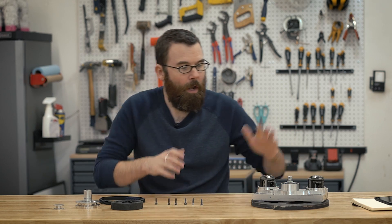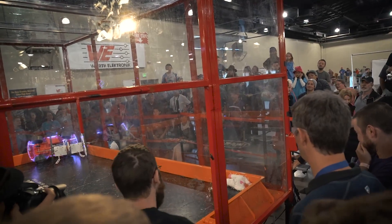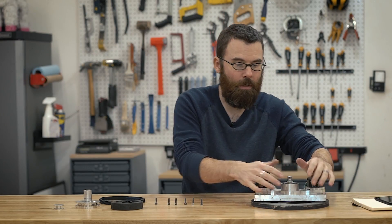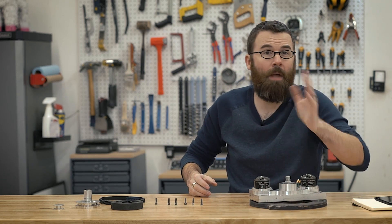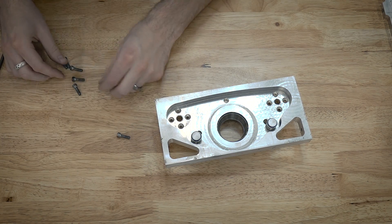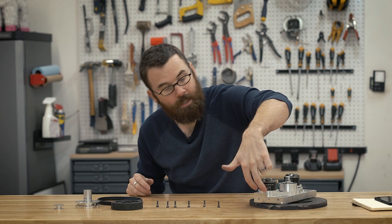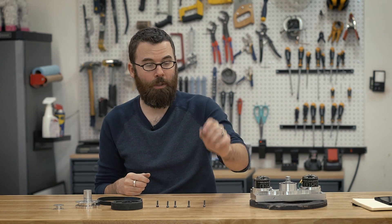The motors performed well. I ended up blowing one of the motors in the very last rumble — I was pushing it way too hard, hitting into the arena over and over just to see what would break. One weapon motor broke, but overall the weapon motors were fine. Spin-up time was good. The bearing assembly is still absolutely solid with no play whatsoever — still very smooth, no changes needed there. The pulleys were good. However, I'm going to need to figure out a different way of mounting this in the frame. These are all the screws that mount into the frame, and they all got bent crooked and cockeyed. I'm probably going to add a dowel pin or similar key so less of the impact stress goes directly into the bolt.